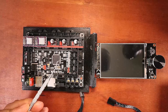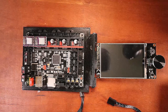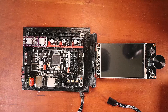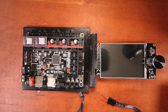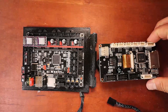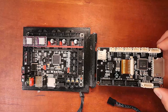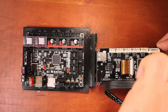We're going to be using the BigTreeTech SKR version 1.4, which is very similar to the Turbo and SKR 1.3. We'll need to configure the Marlin firmware motherboard setting accordingly. We're going to use the TFT version 3.0 and I'll show you how to connect to it. I'm going to rotate this over — you can see where our RS-232 port is, labeled differently by pin. All we have to do is match the notch connector, so I'm just going to connect it like so.